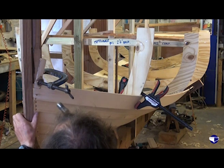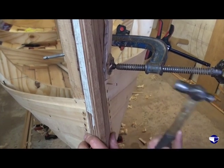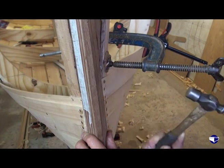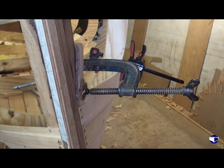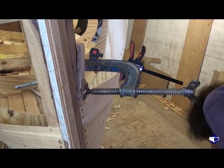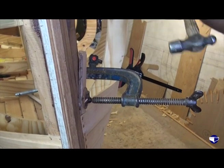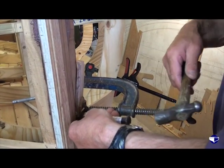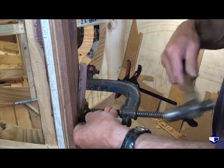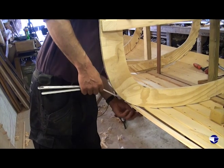It's pretty good to get one in the middle of the half lap. And then we just put one little nail in the top of the half lap, which will probably bend — just helps keep the top in. Three and three quarters there, so we went three inches.